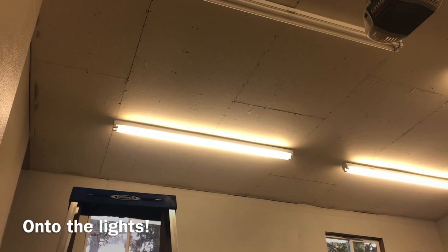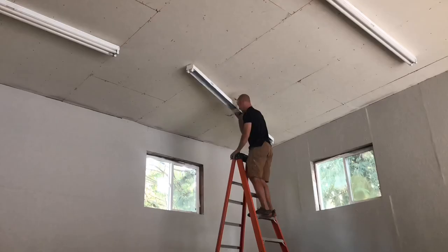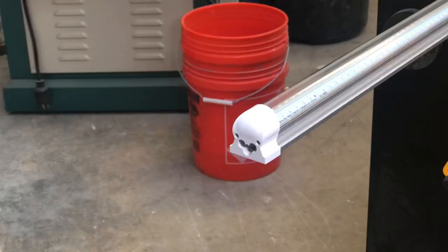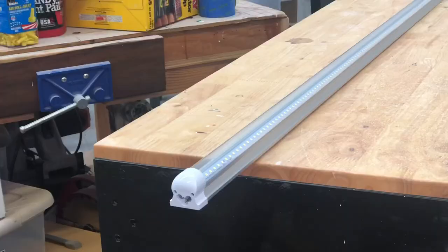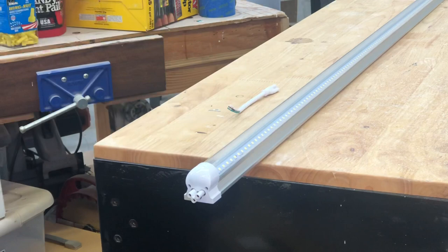Now that I decided I was going to be a radio person going forward, I decided to upgrade my shop lights — something I'd wanted to do since before I moved in. These old fluorescents are super loud, they hum, and they are like 2700K, which means really, really yellow. So I got some new lights on Amazon. These are shockingly cheap and work really well — this is not sponsored at all. I bought an eight-pack for about $150, and they are 96 inches long, 6000K, 9000 lumens, so they are crazy bright. You can hardwire one and link two more to that original one — they say you can only run three to a system.